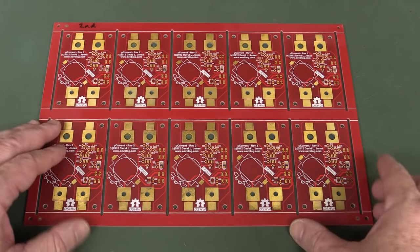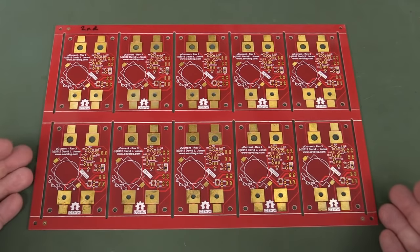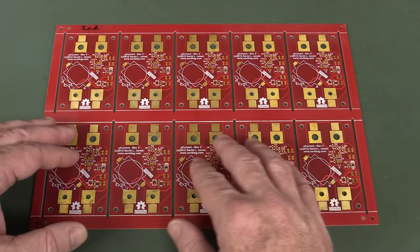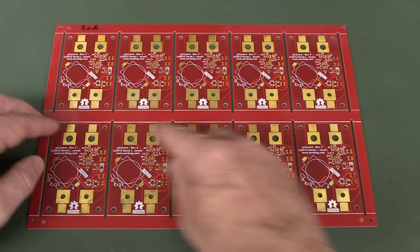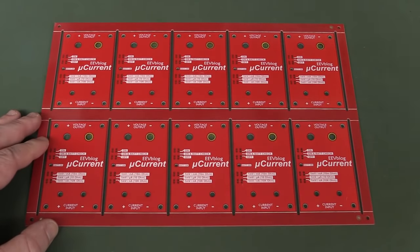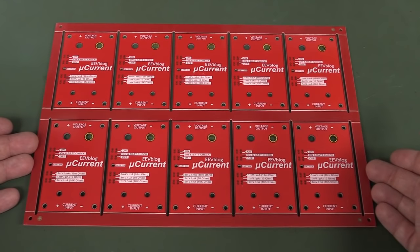You can actually make your own PCBs at home — it's not that hard — but they're not going to be anything like the quality you can get from a professional PCB manufacturer. They're so cheap these days it's almost pointless making your own ones at home unless you absolutely need them in like one hour, because you're not going to get the plated through holes, the solder mask, the silkscreen component overlay, the nice gold flash pads, the V-scoring, the routing, and everything fantastic that you take for granted. You can get boards for $5 at one of these prototyping services if you wait long enough.